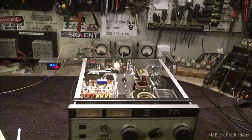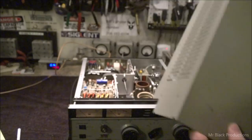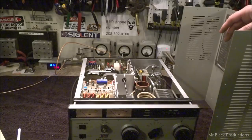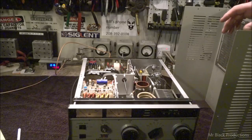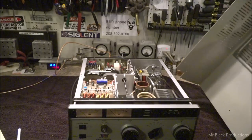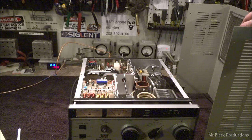Me personally, if I had this box on the lid, so this is your input side, okay? These are your exhaust ports, this side. I'd get myself a little 120 millimeter muffin fan and set it here on the lid, pushing air down in, also to help cool this just a little bit more. The upside to that is this amplifier is literally silent. I mean, it's like The Hunt for Red October, engage the silent drive amplifier, because there's no fan noise associated with it. There's no discoloration, no heat distortion, no nothing. And it's got tip-top, full-output Eimac 3500Zs in it.